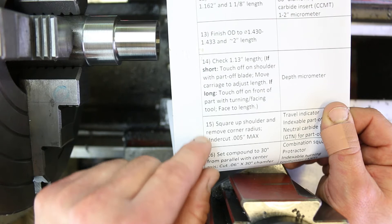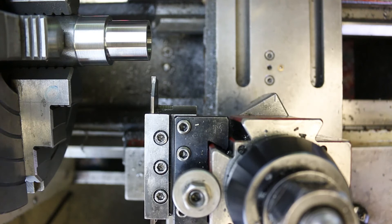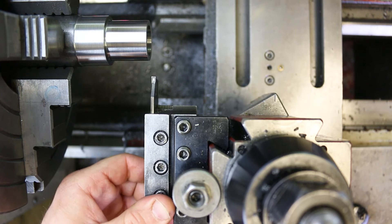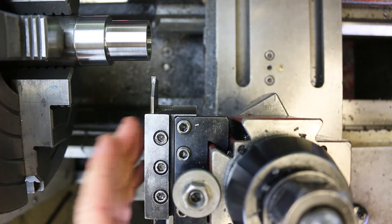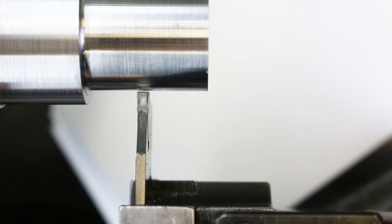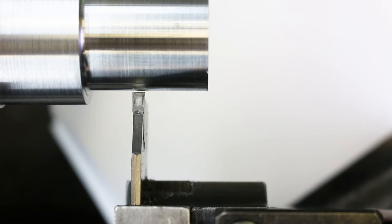I'm going to use the parting tool to square up this shoulder. I already set the parting tool to the correct height, but I haven't set its angle yet — we need to do that right now, exactly the same way as we did for the grooving tool on the threaded shaft project. I'll put my white notepad there for contrast behind the tool, run the tool in a little bit, and adjust it until the gap is uniform from left to right. Give yourself a little pivot point — that's looking pretty good. Let me tighten it down. Now set it up to the right speed and turn it on.